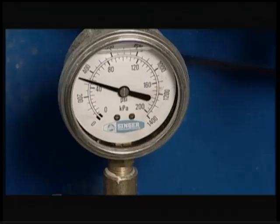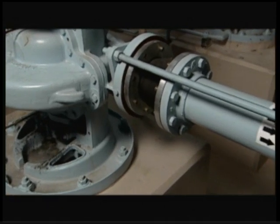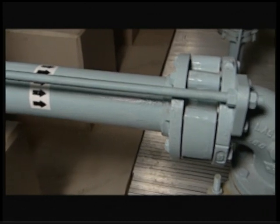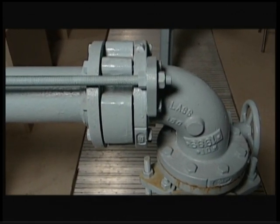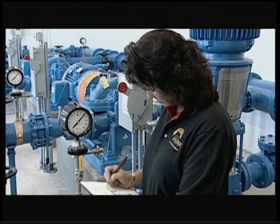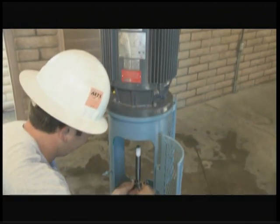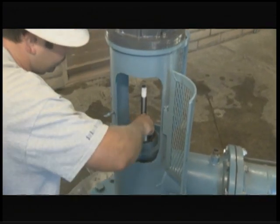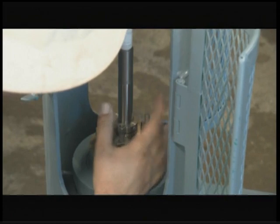One of the biggest concerns in starting and stopping pumps is to prevent excessive surges and water hammer that may damage components of the distribution system. This can be avoided by carefully following recommended procedures and by understanding the basics of how these pumps operate within the transmission and distribution system. Another way to reduce energy loss when starting and stopping pumps abruptly is the utilization of variable frequency drives, or VFDs, to aid in eliminating excessive energy surges.